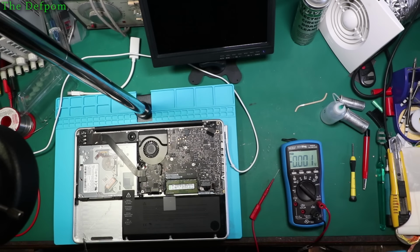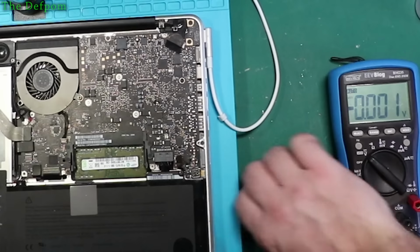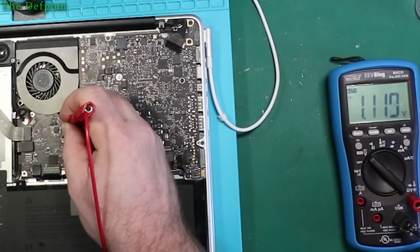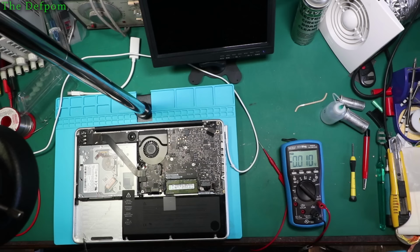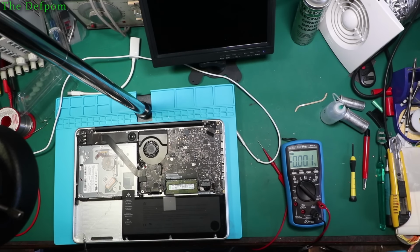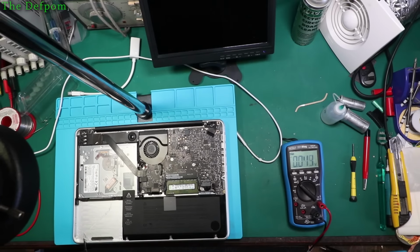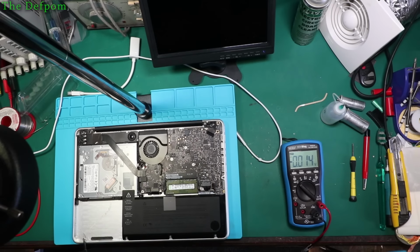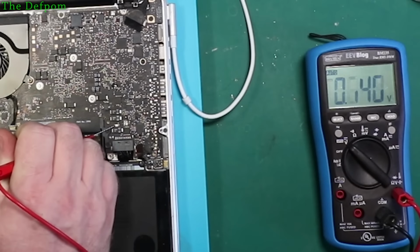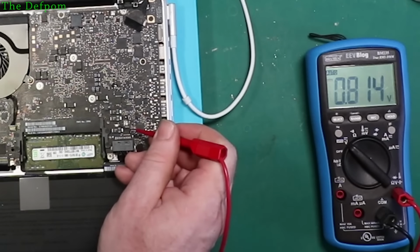Alright. So let's check its power supply, see if it's actually getting any power going to it at all. So, on pin 16, which is going to connect to this device here, that capacitor right there. 1.3 volts, well, that's definitely not right. So its supply going to that chip is no good. So it's further back than that. Okay, let's look at the first supply rail, which should be the main one. I was trying to sort of start in the middle a little bit to give us a direction to go in. Anyway, so PP bus G3 hot is what we're looking for, and that will be on a fuse just here. 0.9, oh, yeah, plug it back in again. Yeah, 0.9 volts is what we've got. So 1.5 volts there, yes, definitely got some kind of issue.